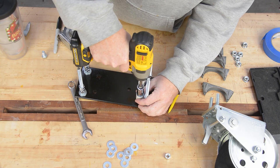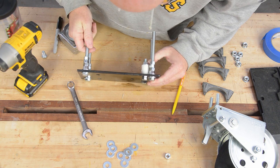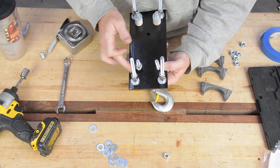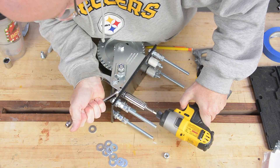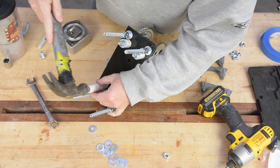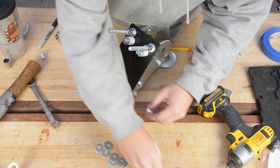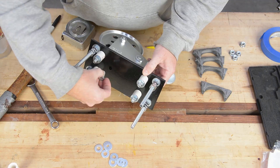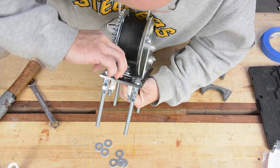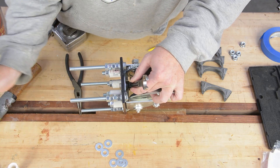There's a washer and a standard 3/8-inch nut on top — use the impact to squish this down until it's exactly level with your stack of nuts on the longer bolt. The other two-inch bolts mount the end of the strap winch. I made the template an inch longer after I built this to allow a little more wiggle room when assembling, and it will require a deep well socket to tighten these because there's no room to get under the winch strap. The last bolt is the 3/4-inch shorty that holds the back of the strap winch. The instructions say to leave the two long bolts loose while you get this in — that's probably a good idea.